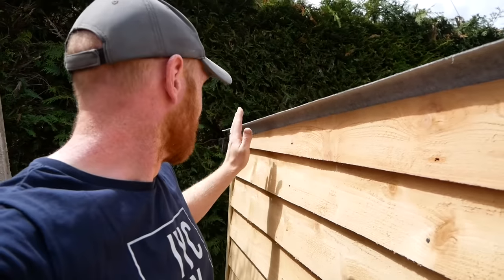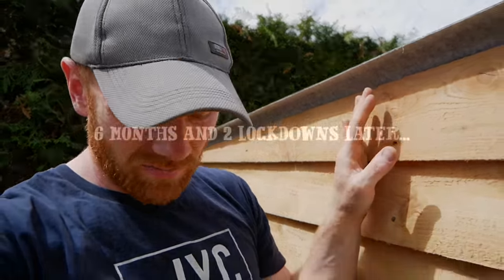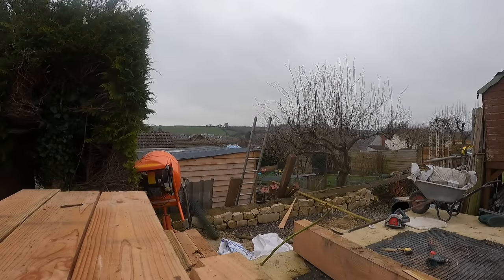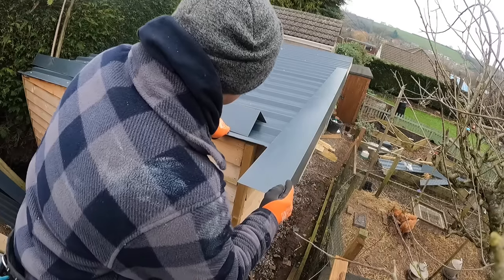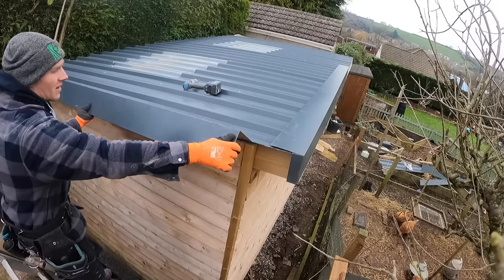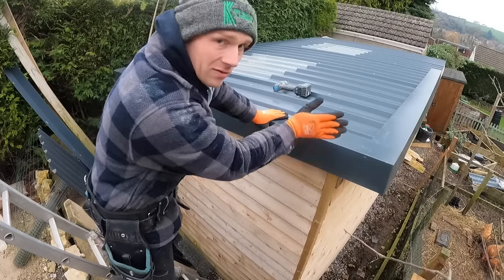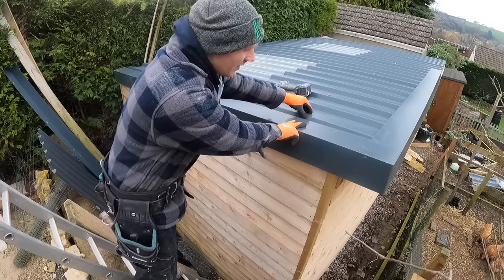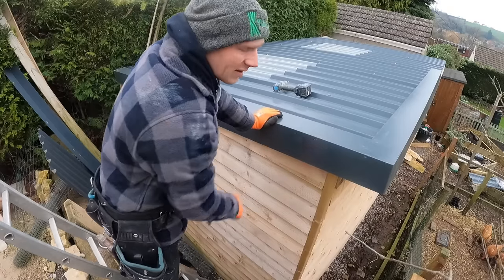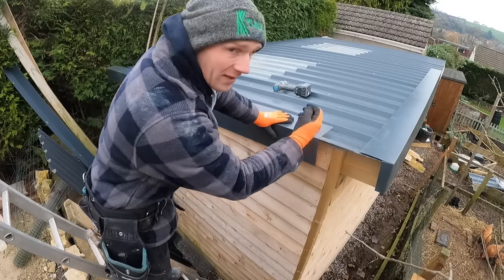Our job now is to get this trim barge board bit on the end, which will cover the gutter at that end and go all the way up to the front. But to do that, I want to make sure I've finished the cladding and get a timber board fixed first to square it all up nicely, and then we can drop that down. I think what I want to do is put a board behind there to keep things nice and plumb with no movement, because unfortunately where our last rib — the raised section of the roof — is, it's not going to hit there. So I'll put a 100mm board against here and that'll give us something to fix into.